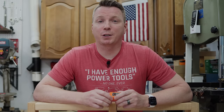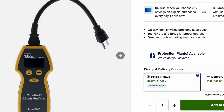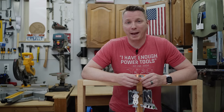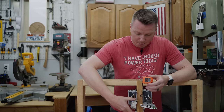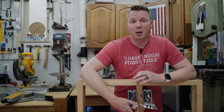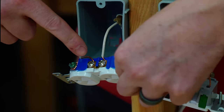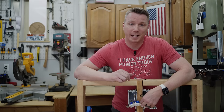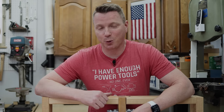If you think you may have a bootleg ground, there are a few ways to check. You could buy an expensive tester like this Ideal circuit tester — but at $421 at the time of filming, that's quite a bit of money. The easier option, even though it's more work, is just to pop off the plate and look behind it. Make sure to turn off your circuit breaker before any inspection. If you see any wire going from the neutral screws down to your ground, that's a bootleg ground and it's dangerous. This is also a great time to check for reverse polarity.